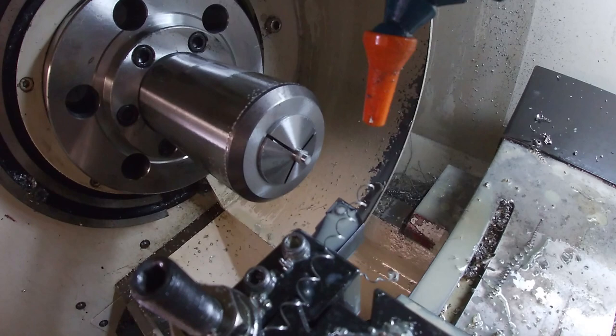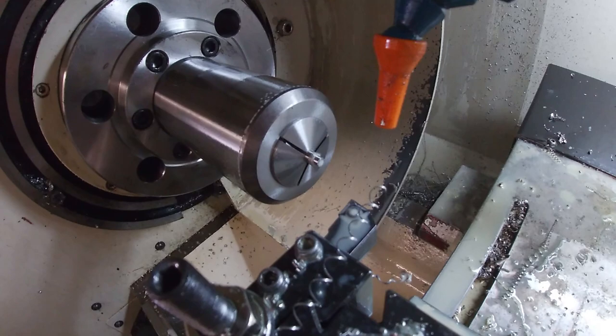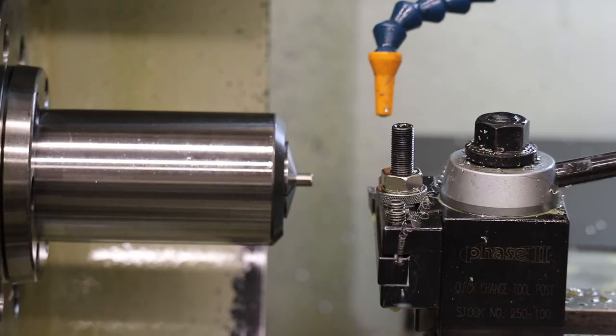So we'll pull this out. And then what I'm gonna do is reset the offset and then do the same operation on the other side of the shaft. So we'll reload the shaft into this chuck backwards and recut. All of the parts I've already cut the first half and they are roughed to length. And now I'm just gonna flip them all over, cut off 18 thousandths and then put the profile in. And pretty boring, so let's just do it and I'll be back when we're done.